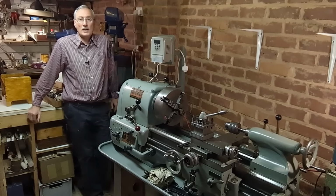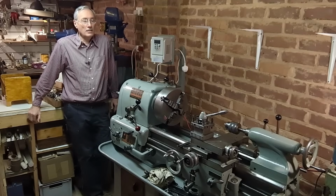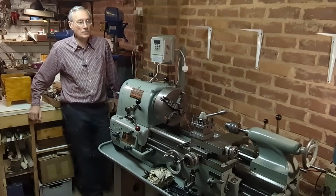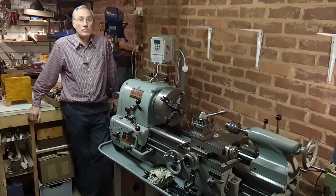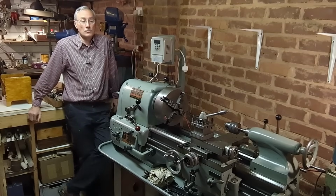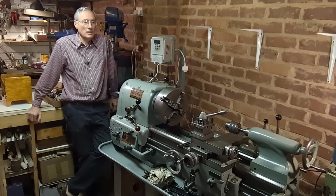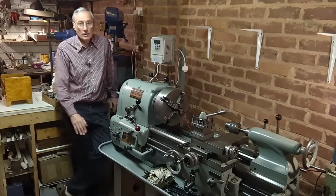The packing box I had actually made in advance before I got there, so that had already arrived before I arrived, and I had help there to receive it. Packing didn't take long. I was able to pack it in such a way that it would not be top heavy. These machines are top heavy, and I've seen examples of them having fallen over, and there would have been plenty of opportunity for that to happen en route. So leaving it in the disassembled state made sense. The packing box was designed to be as wide as it is high, with as much of the heavy stuff on the lower level as possible.